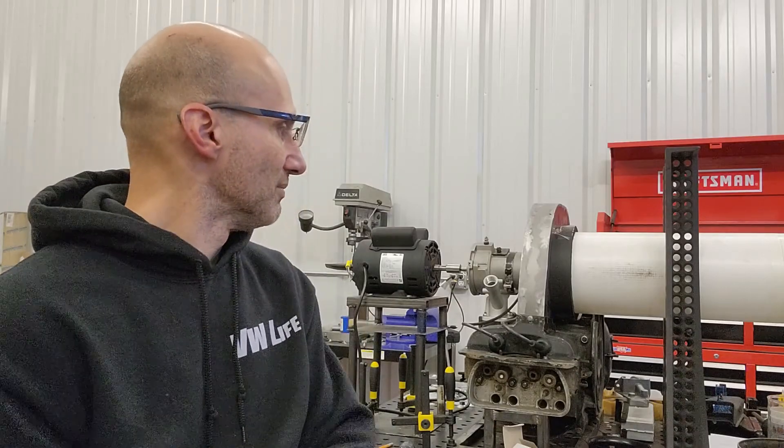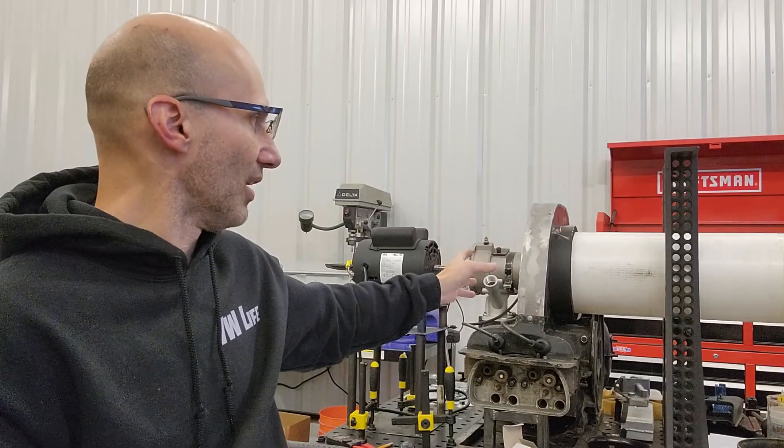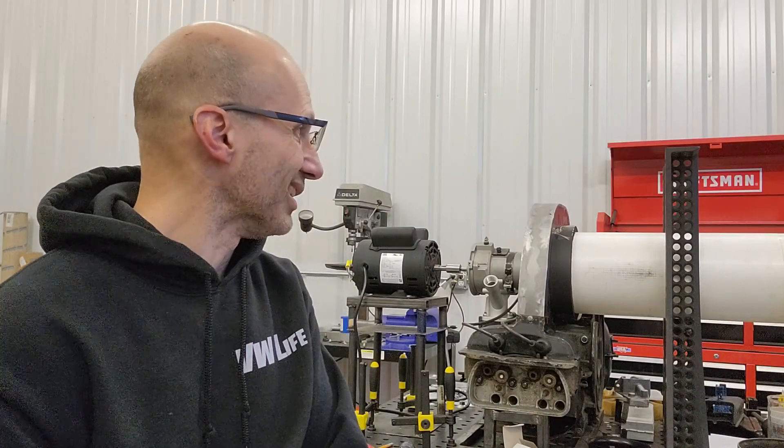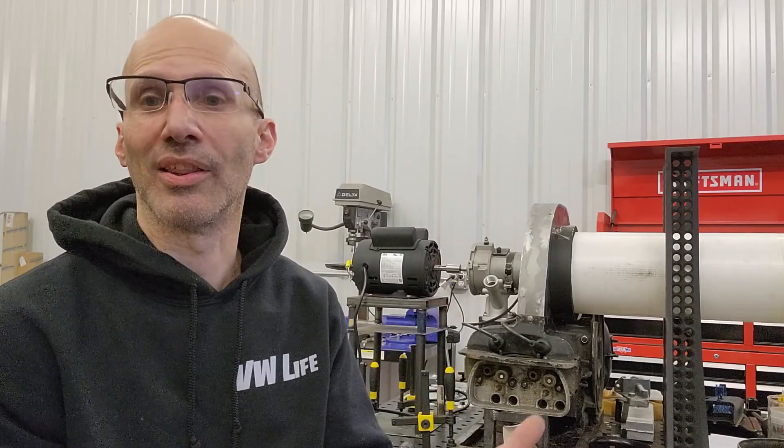I'm not really sure what it'll look like, but I think it actually turned out really good. What I did — besides grinding all the welds flat — is I also beveled the edges. I have a mini metal beveler, and I ran that around all the edges after I ground the welds down, so you get a nice beveled look. I think it looks quite nice. It's bare, so you can see all the grind marks, but once it's powder coated I think it'll look really good.